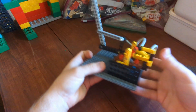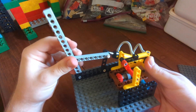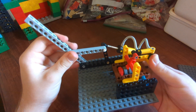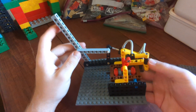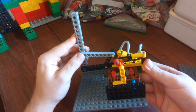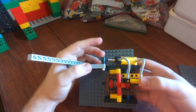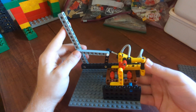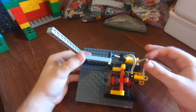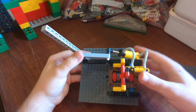Let's get a close-up view of that. In this way, you could have a gearbox that's easy to switch just by having this simple pneumatic system and a lever on the outside of your vehicle. Another upside to this system is you can, if you so choose, attach a motor to drive this cylinder so it could be remote-controlled. That way, the simplest pneumatic system you could have is a motor and two cylinders, rather than a motor, a pump, a cylinder, a switch, and any of those little T pieces that you need.